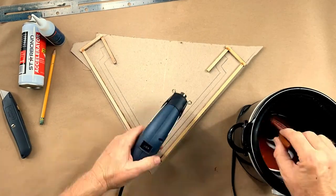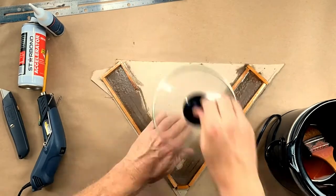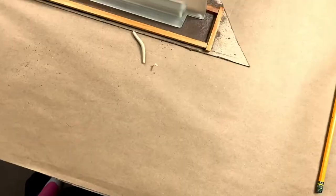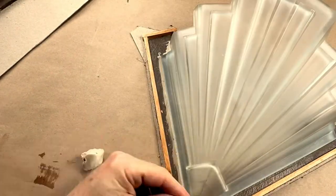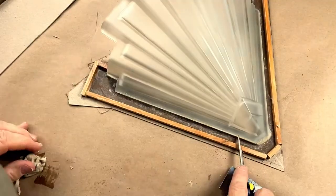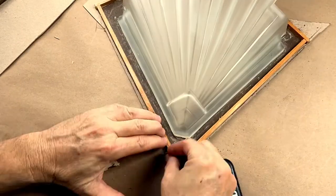Let's fire up the heat gun and get the waxer going. Let's get these parts waxed up nice. Now we have the part set back in the case and what we're going to do is run a bead of oil clay around it. I could run wax around it, but I think the oil clay is going to be quicker and easier to clean up afterwards.